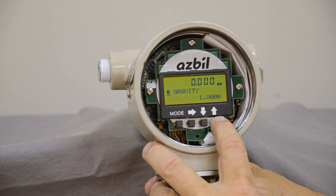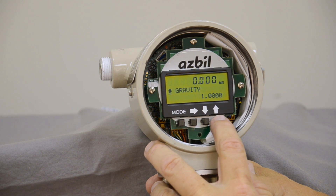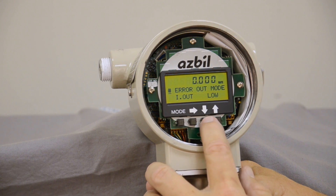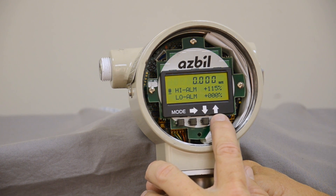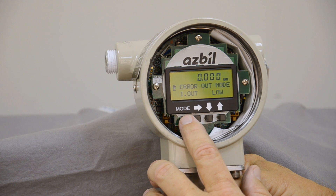When you're finished, you go to the specific gravity setting. It's important that you know the specific gravity of the media going through the meter — you simply put in that number. This one is set to one because that is the specific gravity of water. There are other parameters you can set up like high flow and low flow cutoff, and high flow and low flow alarms, which are pretty simple to do. But at this point you pretty much have already set up your meter and it's ready to go.